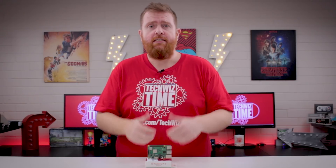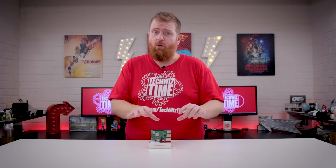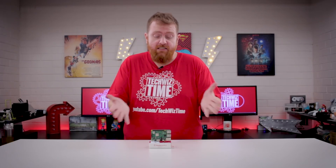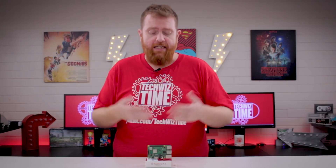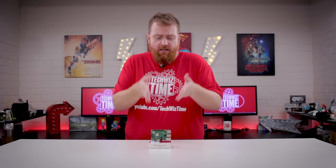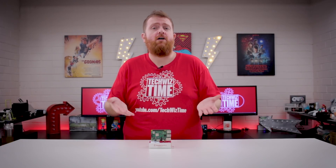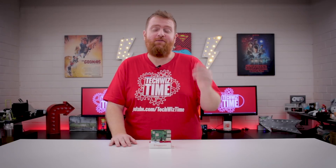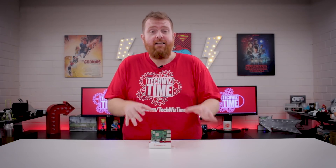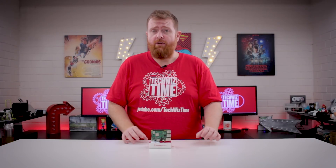The last thing I wanted to touch on is the PoE aspect of this board. PoE is Power over Ethernet, and it's really exciting because if you can power the device through the ethernet port you don't need an extra power cord. If you've got a mid to high-end switch — like a Ubiquiti switch that supports PoE — you could be running 4, 5, or 6 Raspberry Pis just off ethernet cables. It supplies the needed 5 volt 2.5 amps so you won't be underpowered, and it's a one-cable solution.